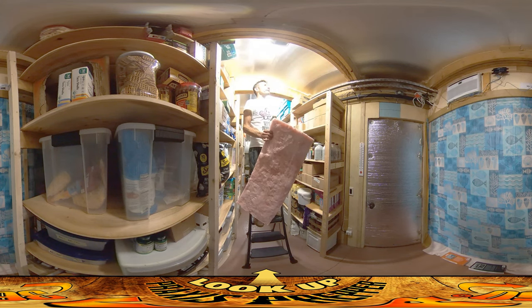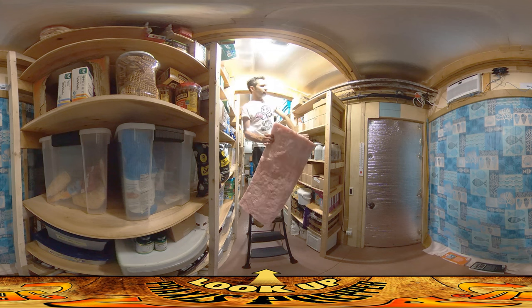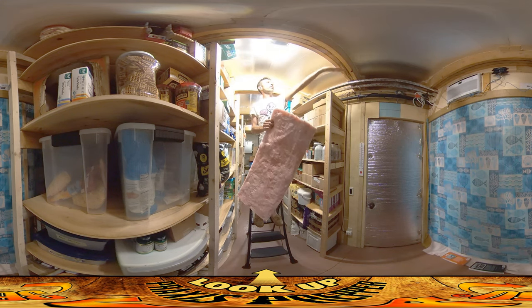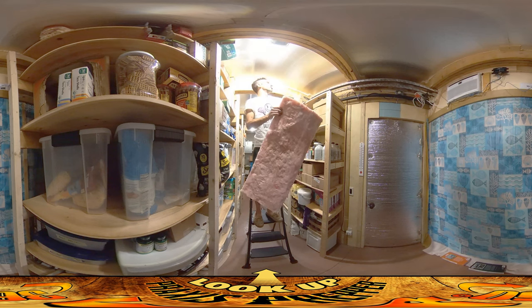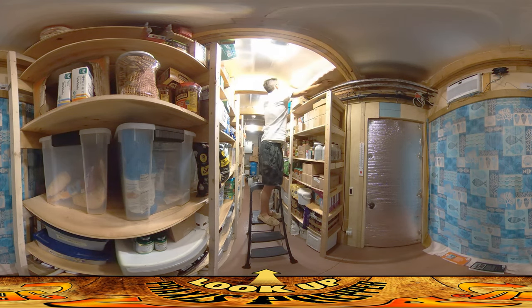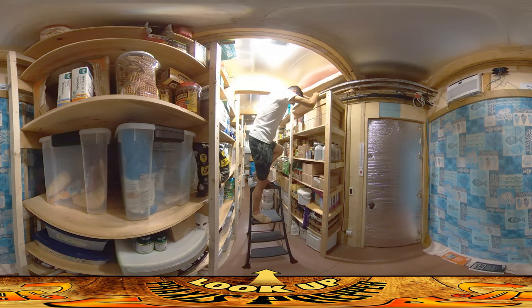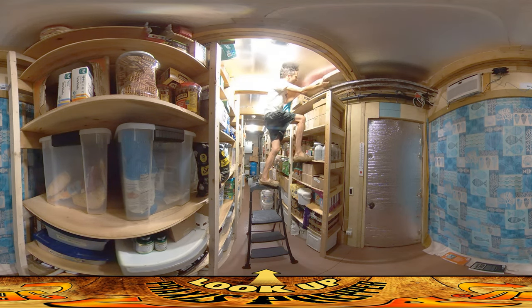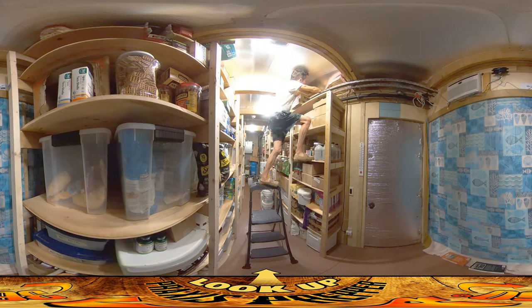That's what I'd like this place to ultimately be — maybe not down to 40 degrees, but a nice 50 degrees would be manageable. One of the steps I need to do to get there is more insulation. I've got four inches of insulation foam on this lower wall, but the section of wall above the beam that holds up the floor rafters — that little section is only about nine inches and it's only three-quarter-inch board, never insulated. So I'm sliding in these little pieces and kind of making little pillows with them.